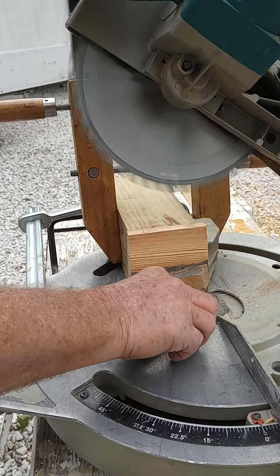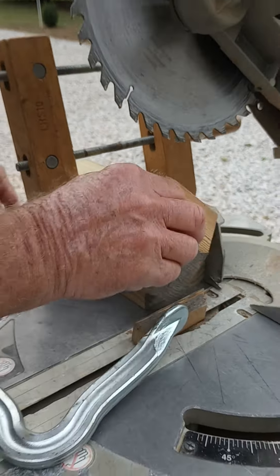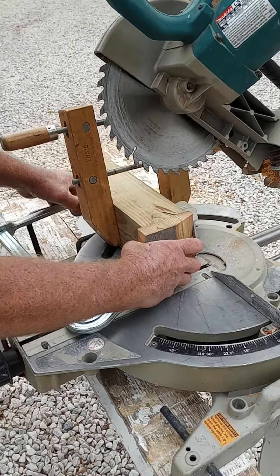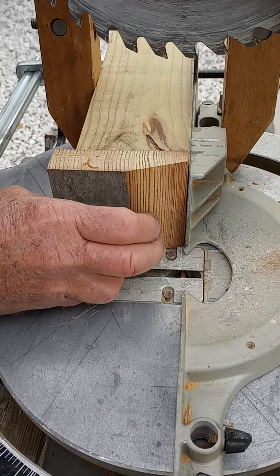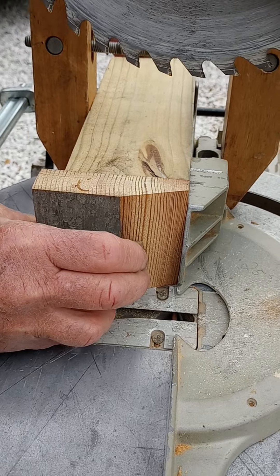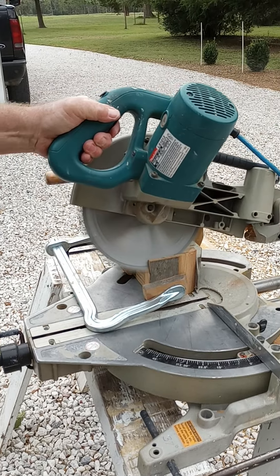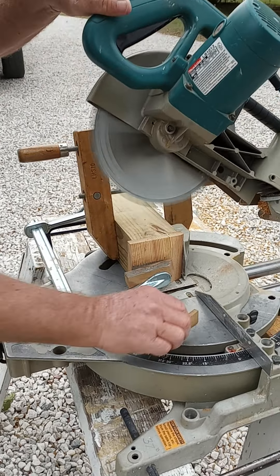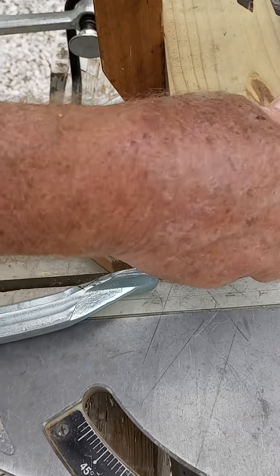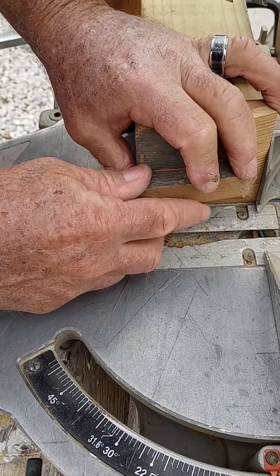I like to make thoughtful cuts slowly so it doesn't make as many saw marks in it. You have to keep in mind as you're rotating this block, you always put it in a safe area and not be on too much of an angle. Always make sure the block is tight up against your fence. This block here is a sacrificial block so that we don't get the blade too close to the large C-clamp, which could be quite dangerous and throw out a lot of sparks.